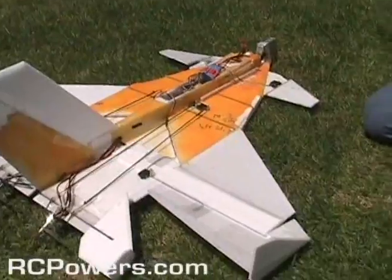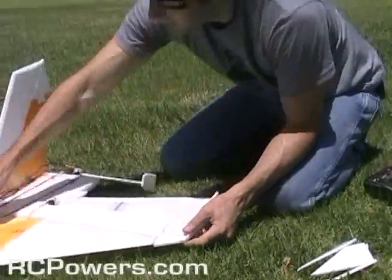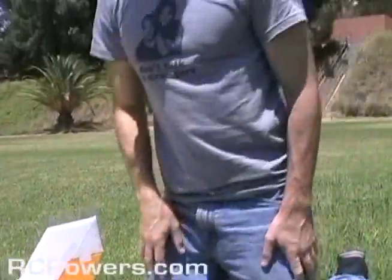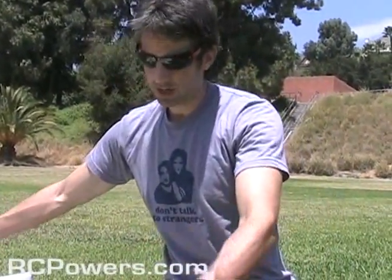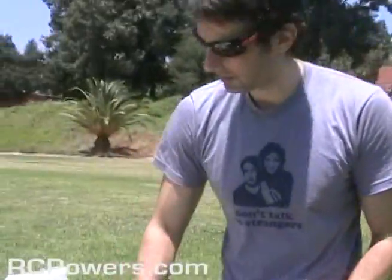Alright, let's try cutting stuff off and see if we don't need them. If you're a guy that does scratch building and test flying, what I always recommend is to add way more stuff to your plane. So when you get out in the field, you can start cutting stuff off. Right now I'm making notes — here's the wing size and setup. I'll cut a couple inches off, try it, cut a couple inches off, try it, and keep going down to where it becomes unstable. Then I know, okay, here is unstable. So right in here is where I want to make the next one, and now I have some solid numbers to go off of.